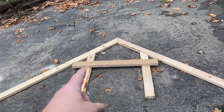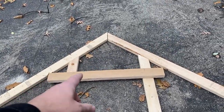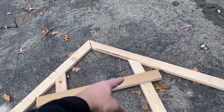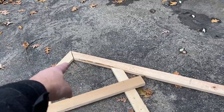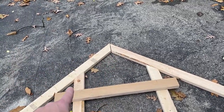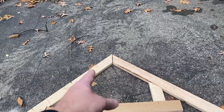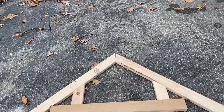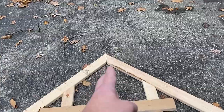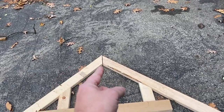But what I'm going to do is kind of a modified attic type design, and so it'll be something like this. We'll cut these off here, there, and I'll probably put a small little triangle up there, and then these will all be kind of laminated together with pieces of plywood and OSB and scraps that I have around. You saw at the beginning there, I just held the truss in place and got a general idea of my angle, and then I cut both of these pieces at that same angle. Those will marry together to create the peak.